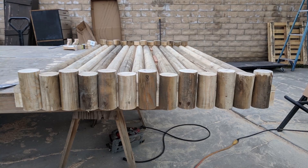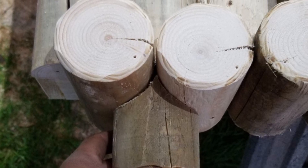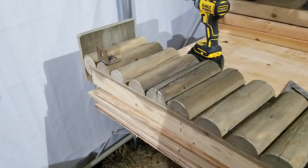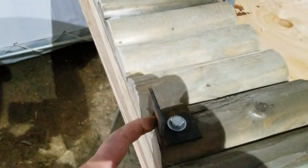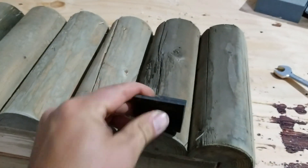The tricky thing on this facade is cutting the logs so they look notched and stacked like in real log cabins. I'm going to cheat a little bit and cut them like Lincoln Logs. On one of the sides, to mount it to the wall I've got a couple of L-brackets on top and bottom on both sides. I drilled a hole through the log with a backer block, and it's through-bolted with washers, so that should be more than enough support to anchor it to the wall.